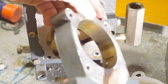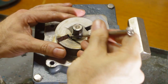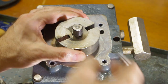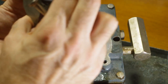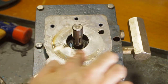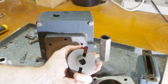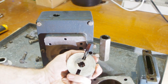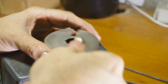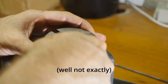The case looks good — I don't see any grooves or rust in here either. I tried to pry the stuck vane out but it was really in there, so I removed the guide pin and the spring from the other side. The valve plate looks great; I'm starting to think this was a good investment. After a couple more failed attempts to get the vane out, I had to beat it loose with a drive pin. Unfortunately, when I tried to pry that vane loose, I raised the surface of the rotor. This is a precision-ground surface with the case and rotor machined to exactly the same thickness, so before I put it back together I'm going to have to flatten it back down.